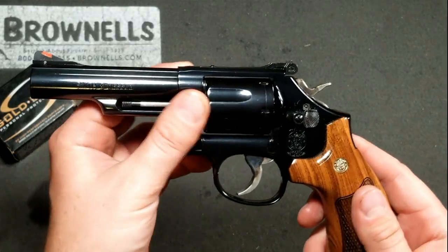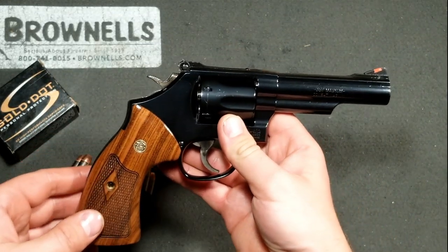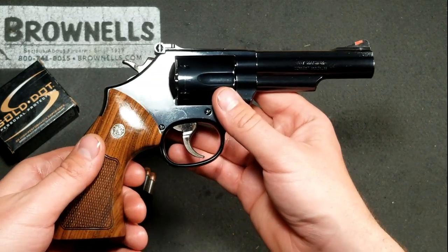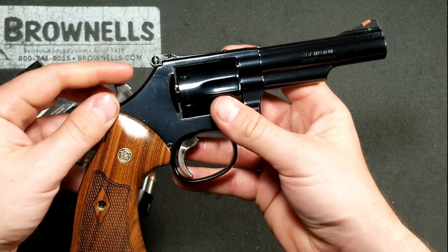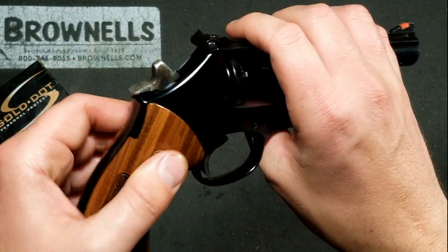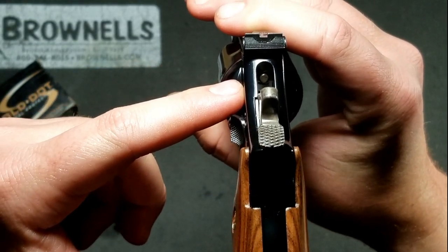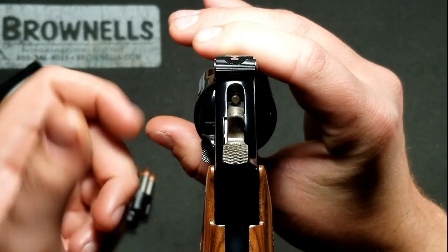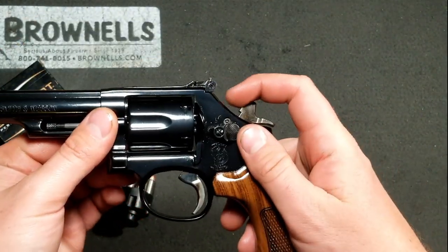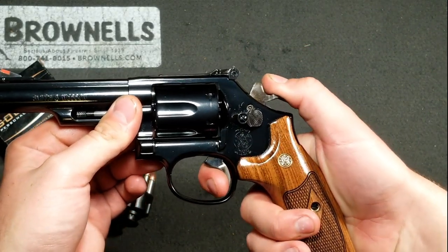I'm not going to get into all the details that make this different, but as a summary: if you were expecting an exact reproduction of an original Model 19, this is not it. We're missing things like the fixed firing pin, which from an armorer's mindset I actually see as an enhancement on the design. We actually have a frame-mounted spring-loaded firing pin, and the hammer is just the inertia device. Mechanically, I actually see that as better instead of having the firing pin fixed on the hammer doing all that work and inertia.